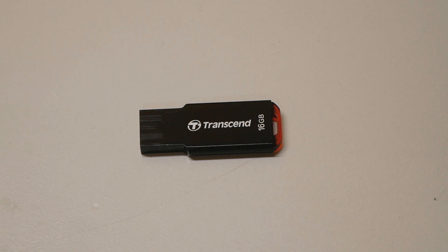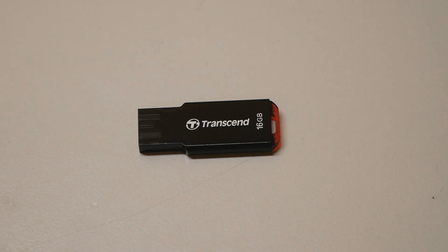So just follow these steps if you have issues with the BIOS update function — try to find this particular USB stick model or a similar one. Some people even tried the tiny USB stick EVGA bundles with the latest motherboard generations, the one containing all the important drivers, but it actually failed based on reports from those users. So it doesn't work; you're better off finding an old USB 2.0 stick like this.